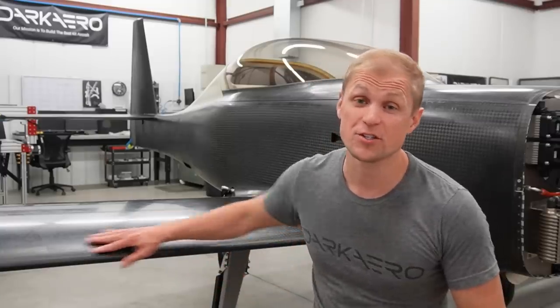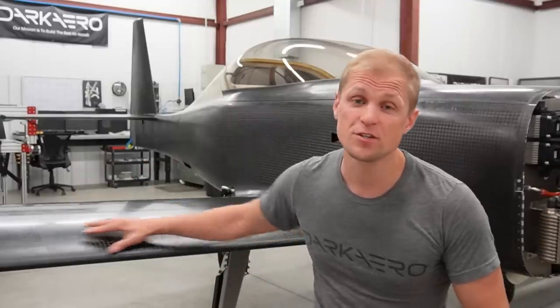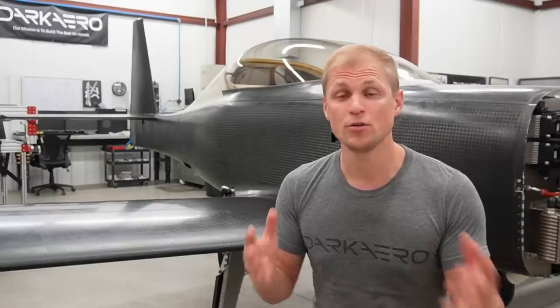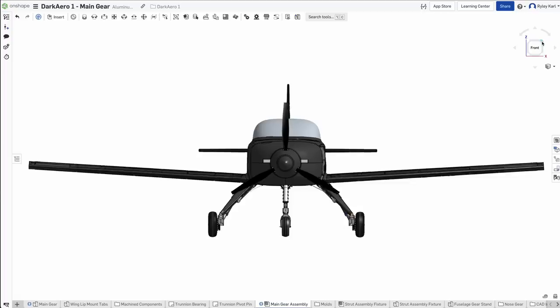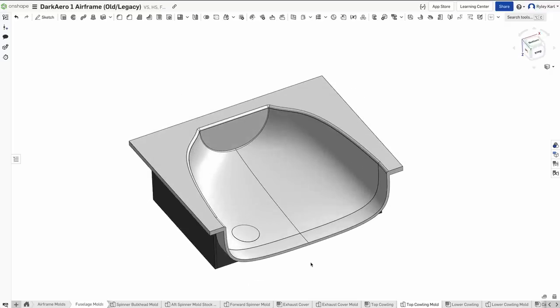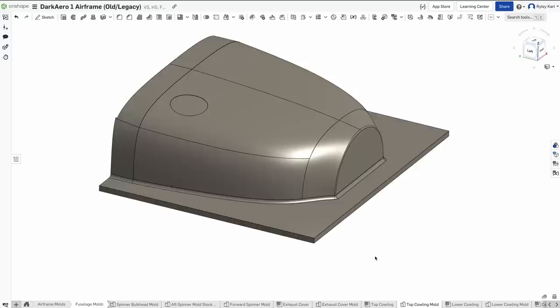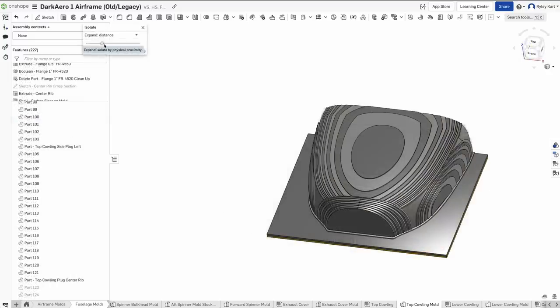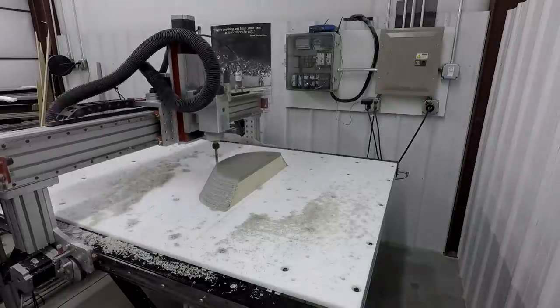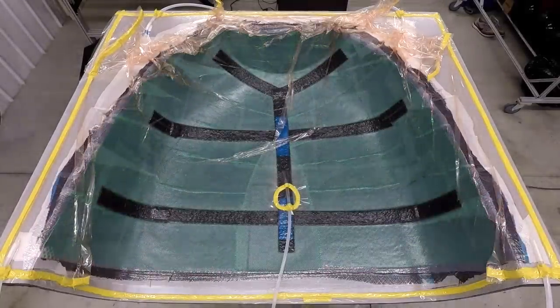The infusion process allows us to achieve a good surface finish on our parts. Getting a good surface finish is important along with achieving dimensional accuracy — otherwise you have to add a bunch of filler material to the surface, sand it down, and all that extra filler adds weight. The way around that is to build precise, dimensionally accurate parts using precise molds, which we create using CAD and CAM tools. We used Onshape as our design tool to 3D model the entire Dark Arrow 1 airframe, all the molds, and the patterns to make the molds. We then used those CAD models to create CNC-machined molds and patterns, which ensures dimensional accuracy and a good surface finish on our parts.